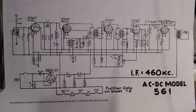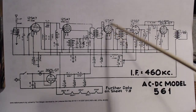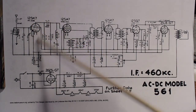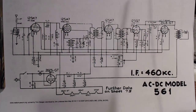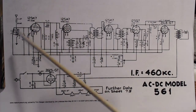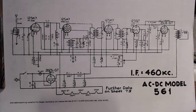So why would this radio not be working well? I'm suspicious of the tubes - suspicious of all of them. This one will be producing most of the gain. Having this tube out front will knock away a lot of noise - a lot of radios in my shop are just overcome with noise. This front-end tube will prevent spurious signals from getting in. Once noise gets past the front end, you get all kinds of weird stuff, and tuning across the band you just pick up junk - usually from a weak front end.